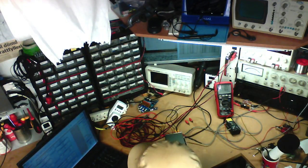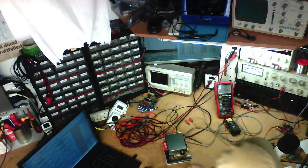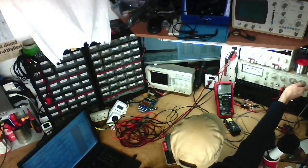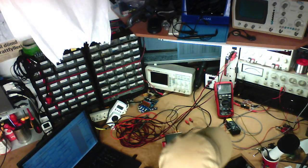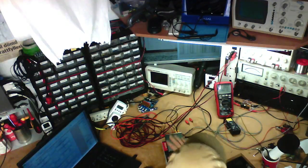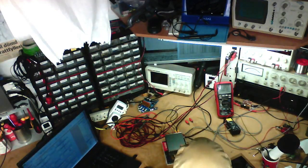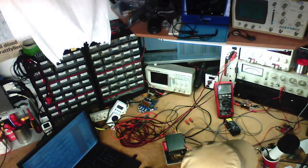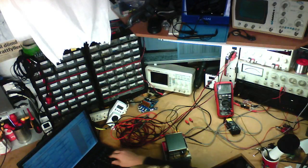So this amplifier is really sensitive to 4 ohm loads, as far as high-end frequency response is concerned, anyway. I mean, at 20 kilohertz, yeah, we're down 6 decibels on both channels. So this thing doesn't like 4 ohm loads, although in my experience, these little Class D things generally hate 4 ohm loads, no matter what you do, because they're just built for 8 ohms. That's it. Because it's cheaper to do that way.